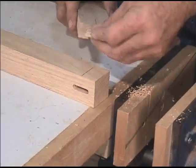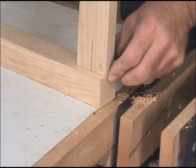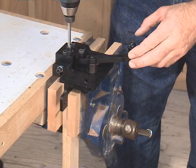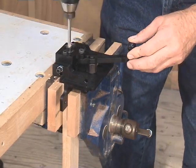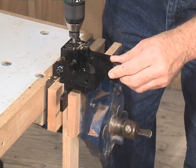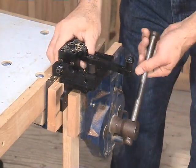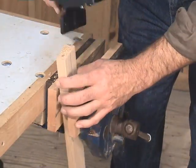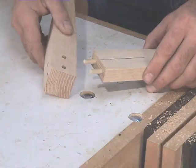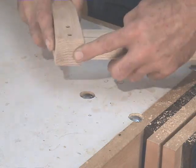You've created a perfect loose tenon joint. When using the pocket mill as a doweling jig, simply drill one hole at each end of the stroke. Center the dowel holes the same way you would center a mortise. Thanks to the pocket mill, the distance from hole to hole has to be the same in every piece, creating a perfect fit.